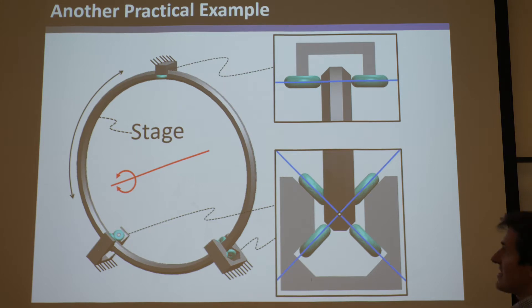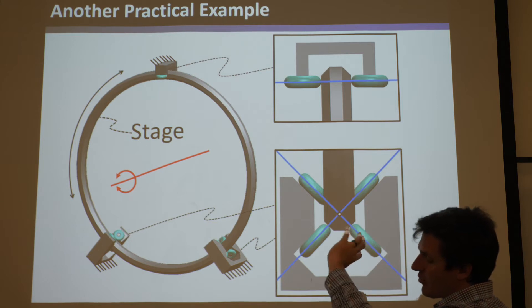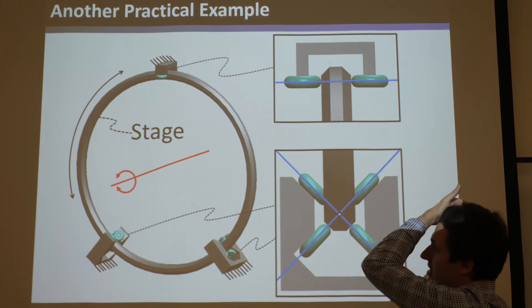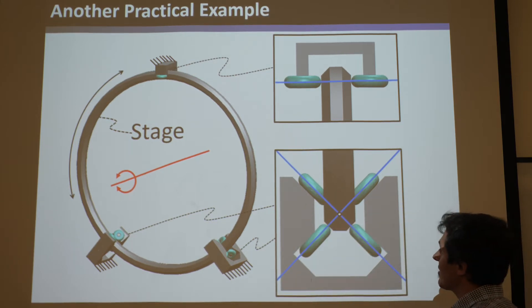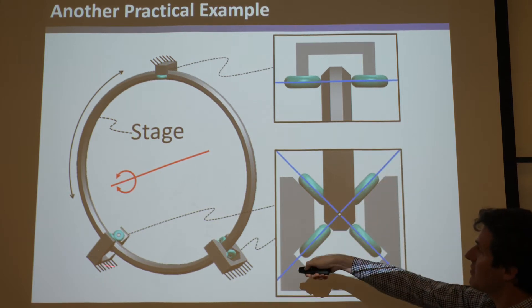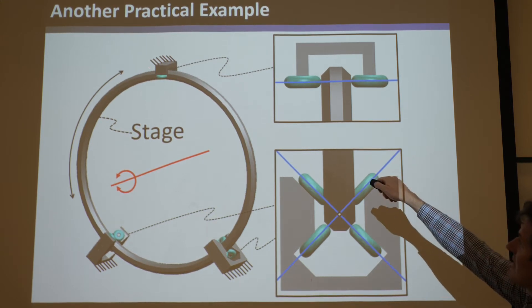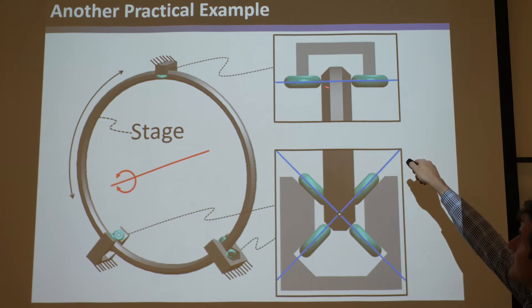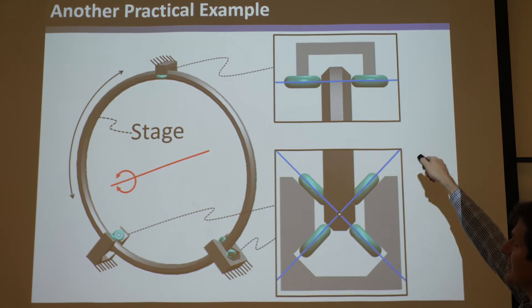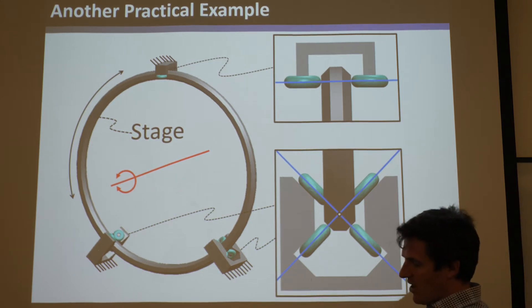The interaction there can be modeled as like a wire flexure. Now let's look at the CAD. Here's the ring - it's essentially an octagon. The real ring is not a regular octagon, but I've modeled it as one where all sides are the same size. You take an octagon and extrude it in a big circle to get the hoop. At the top on two sides, you have it pinned, and the constraint is a wire. It's already over-constrained when you put one on the other side - they're doing the same thing, it's redundant, like two wires on both sides.